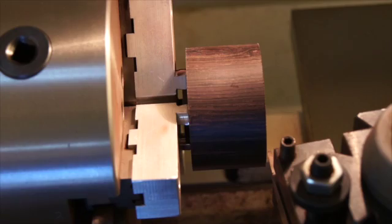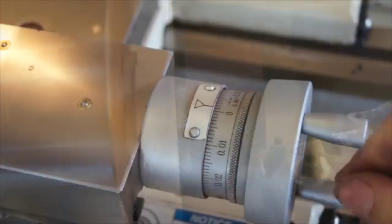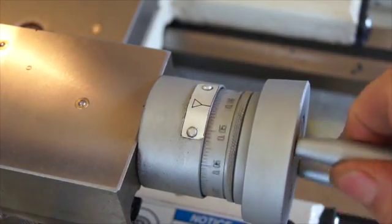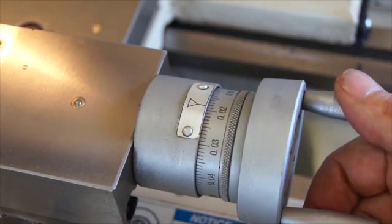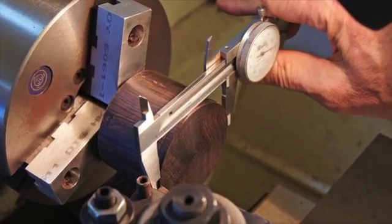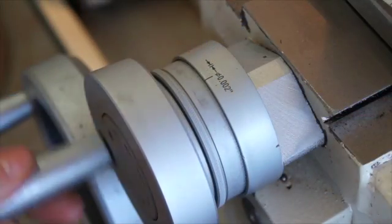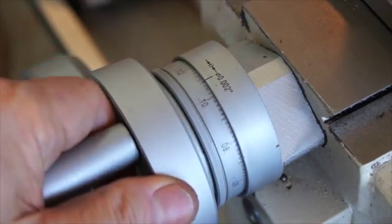Now we take the wood to the metal lathe where we can precisely control the cuts to exactly fit the shape of the silver. Notice the precision. It's easy to control the tolerances to 1/1000th of an inch. We stop to measure the exact outside diameter with calipers and make the final adjustment to get the diameter exactly what we want.